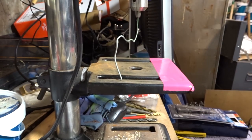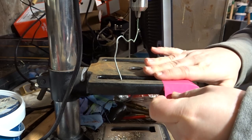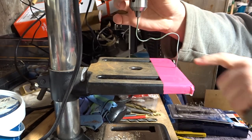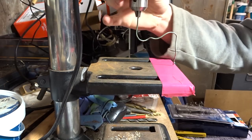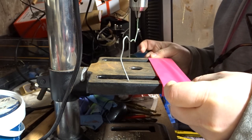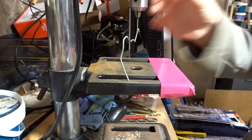But unfortunately I had the problem that it was front to back that it was out, and there's no adjustment for that. Unfortunately there's no screw or anything like that. There is a mod that you can do that adds basic adjustment to front and back, but I didn't really want to get into this right now, so I found a tip online that's similar to the way we fix the bed on the 3D printer, and that's just to layer tape on the low spots and build it up until it becomes the same level all the way front to back.